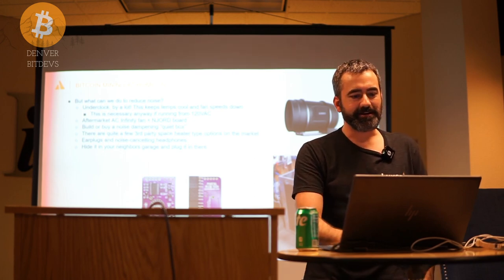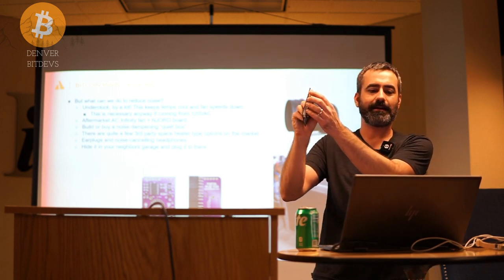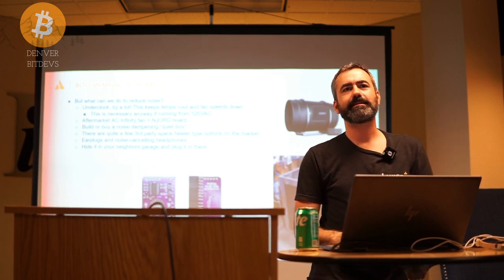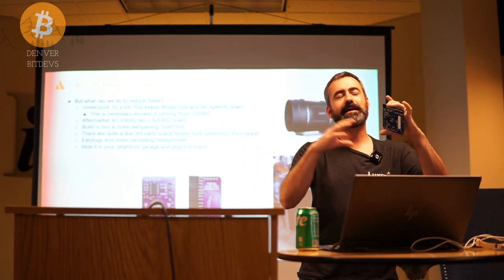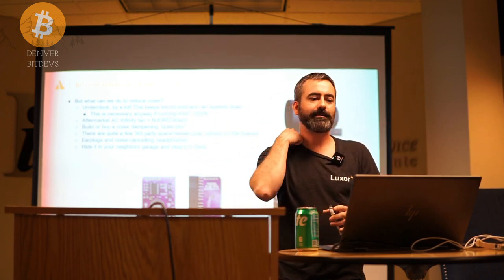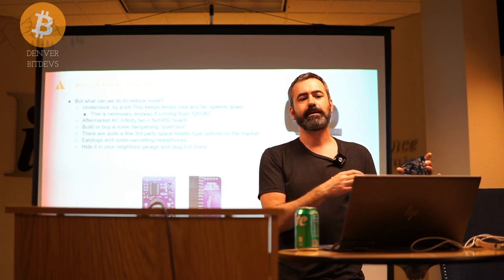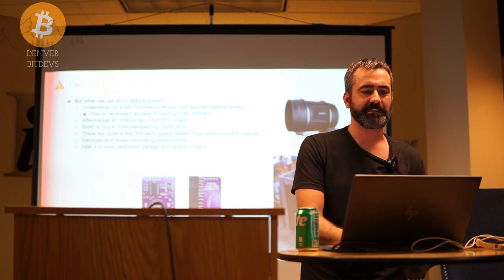So another thing to think about is noise. Zach also has this, I don't know if I'm saying this right, but a Njord board. It hooks into the fans here. And then it has a USB output that interfaces with AC Infinity and maybe some other third-party fans. And then if you're using one of these bigger fans, kind of the idea is if it has enough CFM or airflow, and it's a bigger diameter, it's going to be quieter. And you can kind of bypass those fans, but you have to do it in a smart way. But especially if you're underclocking, you'll be able to get sufficient airflow, and then it's going to be even quieter probably than this setup here with the stock fans.